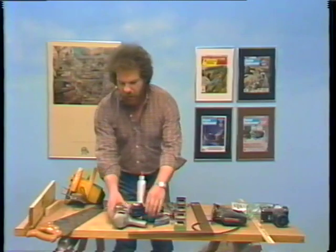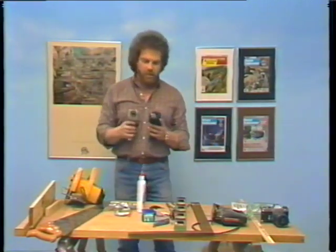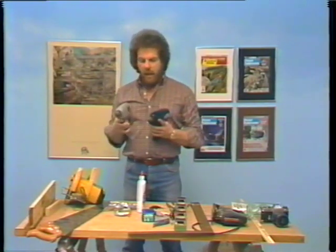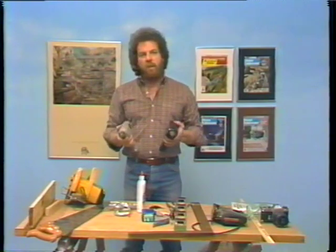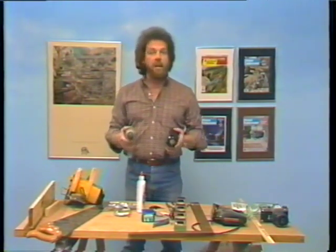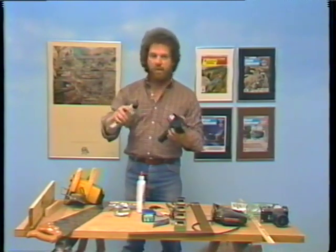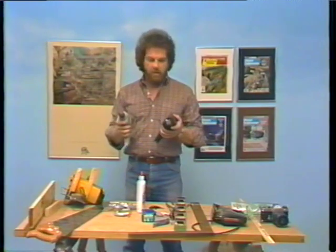Now, when you get the members cut out, you want to put them together with screws, and you're going to have to use two drills to do that. The reason I like the cordless drills versus the common drill is that the cords get in the way. Once I'm moving quick on benchwork, I tend to start tripping over cords. Also, I drape them over finished scenery portions, and it causes damage. It may break trees or move things around that you don't want moved around.